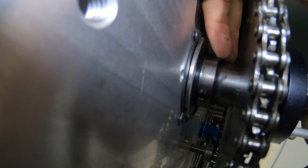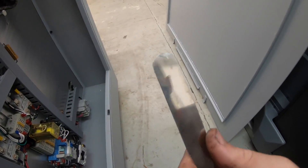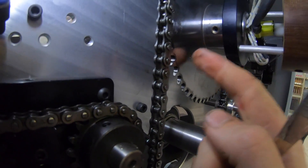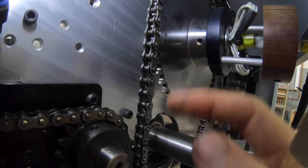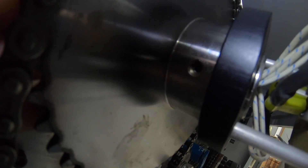I'm trying to determine a better way to do this. If I got a collar to put in here it wouldn't be able to move over. I gotta try and measure that — yeah, so a collar exactly the size of that should work, and then that'll keep this gear from traveling over. That'll solve the problem forever. It's not going to rub on anything because this is fixed and that's fixed, so I just need a collar that'll act as a spacer and keep that from moving over.